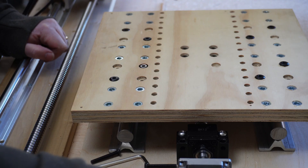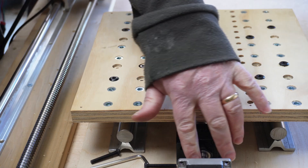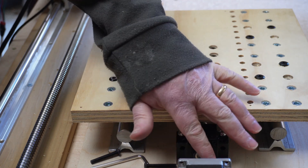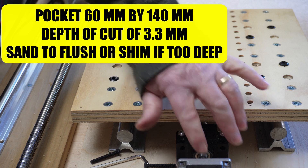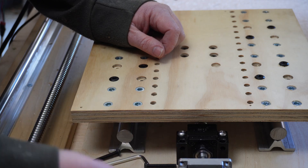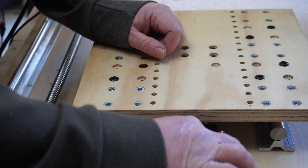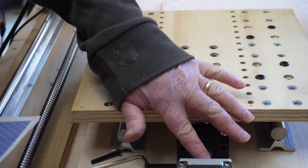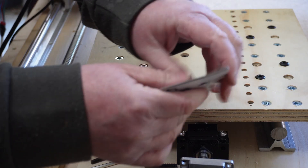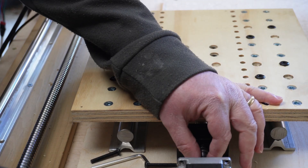We need to get the motor on. First, line up and feel the shafts — if you cut the pocket perfectly, the round side of the shaft lines up, noting there's a flat side too. I cut this about a millimeter too deep. If you err, undercut the pocket — I'll give you recommended dimensions to start with. You can always sand it down. What I'm going to do is take a few playing cards and place them underneath until I can feel with my finger that it's aligned. You want to get that axis as concentric as you possibly can.